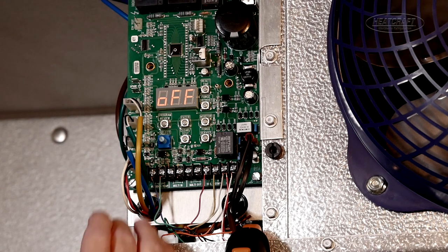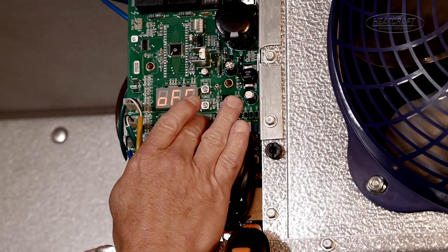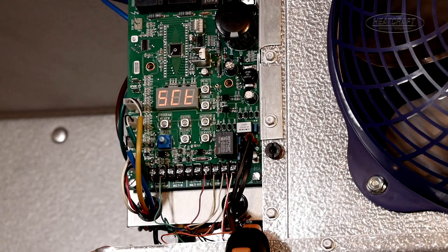Now we can go to our suction sensor to see if it's the proper calibration. It is listed as SCT — suction temperature. We are in a non-refrigerated box right now, so this is actually showing the box temperature, but this one is correct. If you want to compare this temperature shown to your clamp-on thermometer that you put on the suction line, that's how you're going to check the accuracy of it.